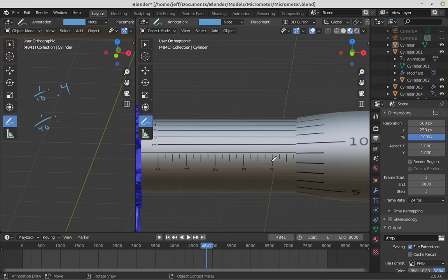We're past, again, the 0.4. We're past the third 40th of an inch mark, so this will be 0.075. For the 1,000th of an inch reading, it looks like we are past the 5, 6, 7, 8, 9. We've passed the 9, we're not yet to the 10, so I'm going to read that as a 9, 0.009.